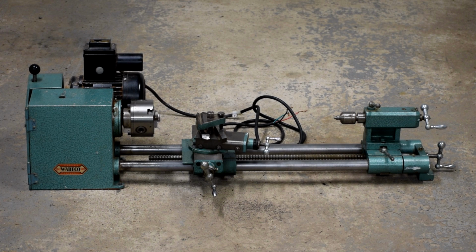we have two problems. The first is that this handle has actually been bent. It's been hit with something heavy and it's now off axis. And that's going to make driving with a motor problematic because there's no really good way to straighten it back out again. The second problem is that the lead screw itself has a lot of backlash in it. There's a lot of slop. And there's no really good mechanism in the OEM design to be able to take that backlash out.